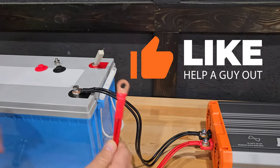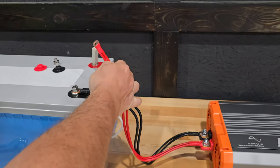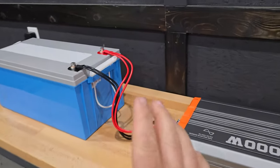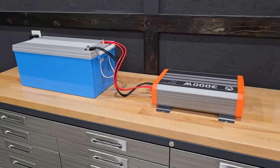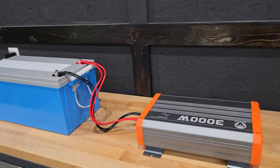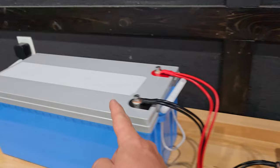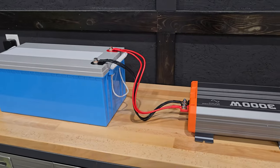I have a little resistor here to keep a spark from happening when you tap the cable to the terminal. You put the cable on the resistor first, touch that to the terminal, and there won't be a spark. This is not my recommendation of how you would normally hook this up - you need a lot of safety features in between, including a switch to shut down power and fuses that would blow rather than burning up the inverter or damaging the battery. There are many things you could put in between to protect the system.